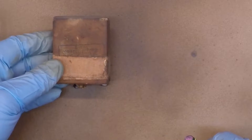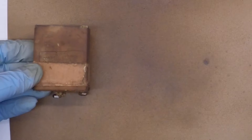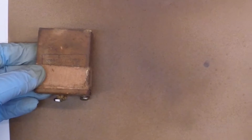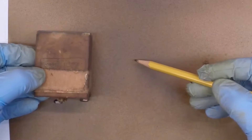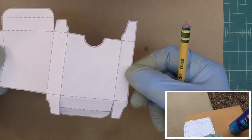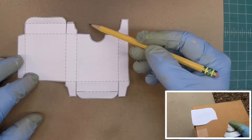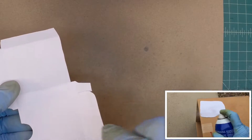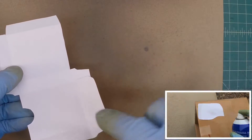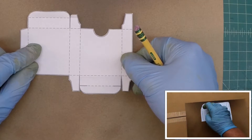How perfect — it gives it some patina and some age. So I'll cut this with probably this side being the outside. You can see with the old toner lacquers that were sprayed, it gives it that old look. I'm going to go outside and spray this, but I'm going to use some of my multi-purpose adhesive and spray the back side of my template. Then I'll lay it down on top of the cardboard and cut around it.